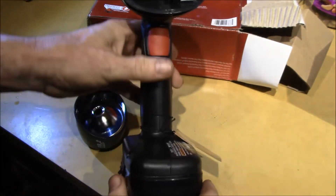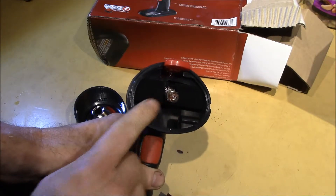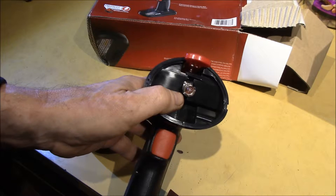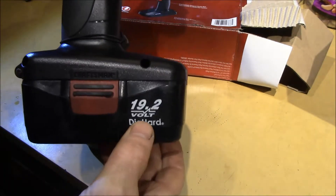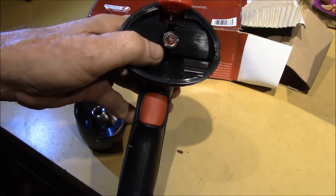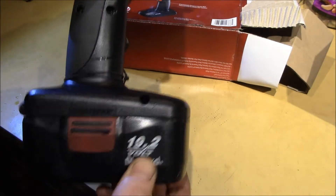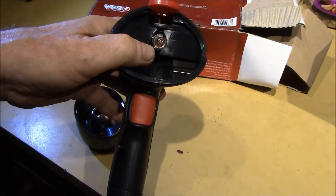One of the things I wanted to do: I've read some reviews on this and this particular bulb is incandescent - I think it's a halogen bulb - but it's kind of hard to find and rather expensive because it's set up for 19.2 volts. It's not your typical two, three, or four-cell flashlight battery, and it's not a 12-volt car bulb - it's a 19.2-volt special super-duty one.